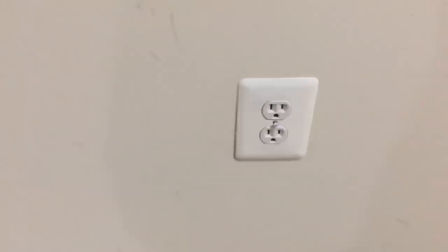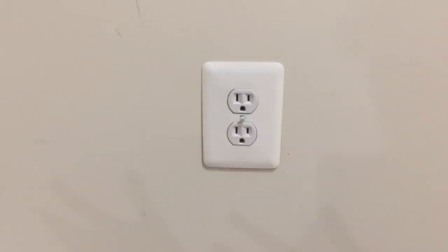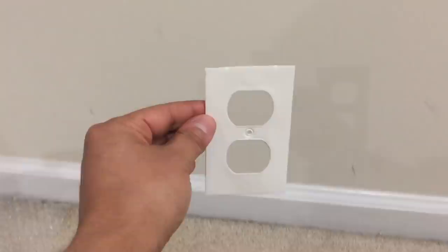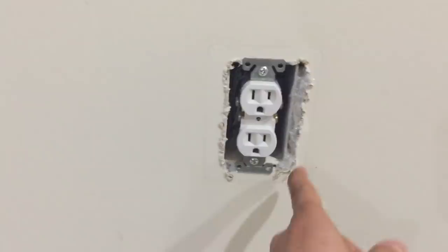Something new to me — I never considered there to be a vulnerability in the wall as it relates to outlets. Outlets are just a big hole in the wall, and they don't often get the same level of insulation because they're just poked into the drywall. I'll show you here: take the screw out, remove the faceplate, and you can see I've placed these little pre-cut foam inserts for the outlet. All you do is punch out the pre-cut holes — remember to punch out the screw hole as well — and place it right over the outlet.